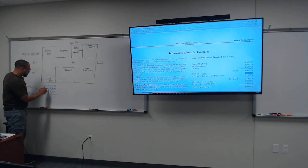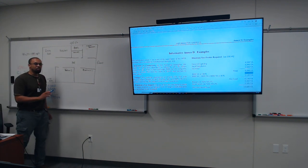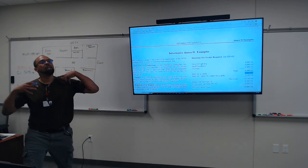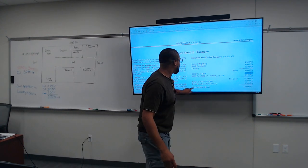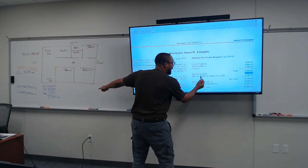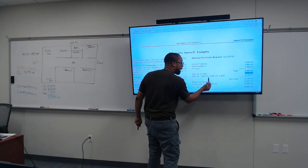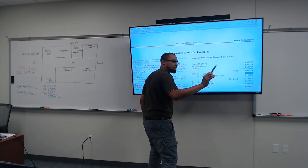So now we have 3,240 plus 3,000 is 6,240, plus 1,500 is 7,740. Is that right? Yep. So we have a total of 7,740 volt-amperes, or watts. Now we apply our demand factor of what you see right here. The first 3,000 is at 100%. Then I'm gonna take my 7,740 minus the 100%, which is 3,000, and take whatever that value is and multiply it by 35%. Let's do that, okay?